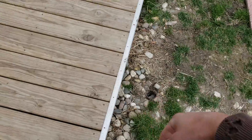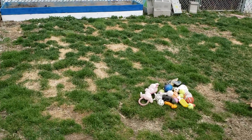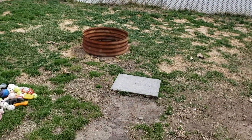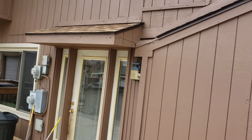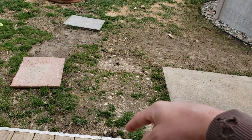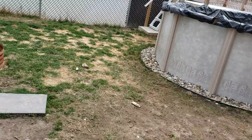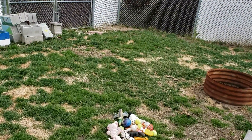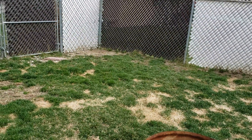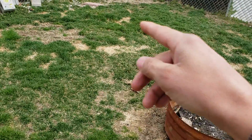There's a fence post here, so be careful with the sod cutter. This fire pit is being removed. This whole area is going to be sodded, but before you do that there's going to be a three-foot-wide paver walkway. She didn't really select a color, so I'll have to ask her — I'll write it in the notes. We're going to try to match the house; I think sandstone would actually look good here. She wants it to curve to the steps over there and line up with that. There's some fire pit block from Ropp — they said it takes 19 of them to make a full circle. The outer diameter is four foot, the inner diameter is three foot. You're going to dig a trench, put your slag sand in, and build a fire pit one course high.